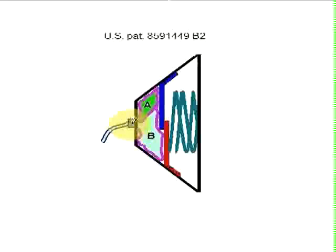This here is a dual aperture valve, and it's obvious that you can control the relative mixtures of fuel and oxidizer simply by varying the relative sizes of the bags. Also, you could control it at the valves with different settings on the valve. This makes for a very reliable fuel delivery system, and it's virtually impervious to G-forces or drastic temperature changes. And electrical interference doesn't bother it in the slightest.